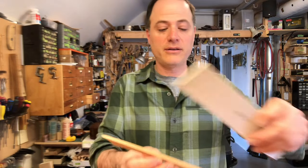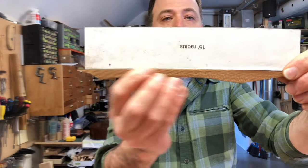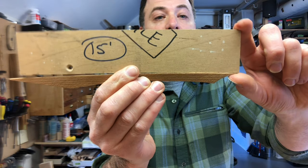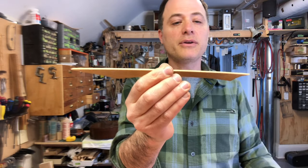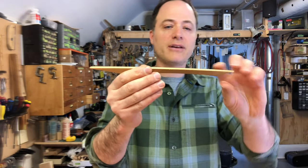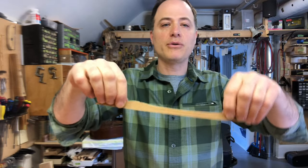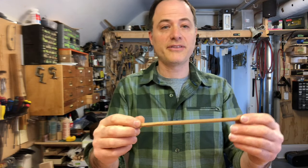As a little segue, you can see this is a 15-foot radius guide right here. I can show you this side — so that's the radius of the top. You can see right here how it doesn't line up — there's play right there. The radius of the brace gets a little tighter right here at the end, which is a big part of the reason that Gibson brace ends are often loose. Often the ends of the braces are misshapen — they have too much radius. When they get glued to this thing that's supposed to have a consistent radius, they pop off right there. I suspect that happened because when they were made, they probably sanded these in a bowl of some kind and pressed down too hard and rounded it too much. But that's a 15-foot radius brace right there. Anyway, this LG-2 didn't need it, but it's kind of cool to still have it.